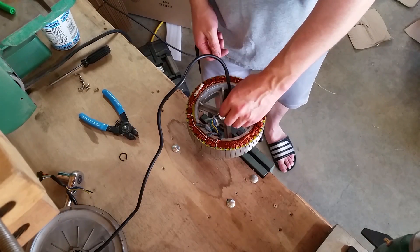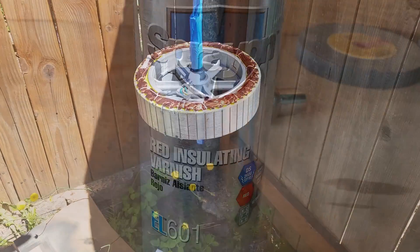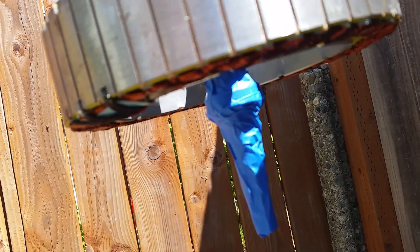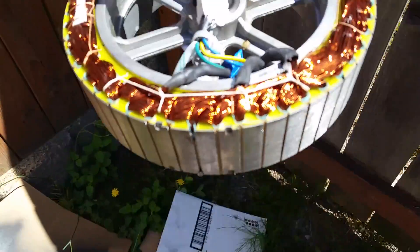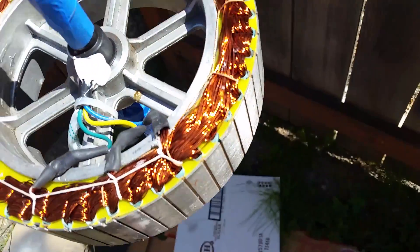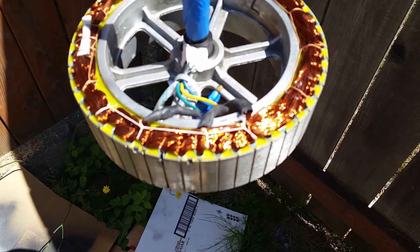So now we're going to take this out and paint it with our insulating varnish. I've taped up the axles so we don't get overspray on them, and there's a bearing still on the axle so I made sure to tape that up as well. The main thing we want to insulate is the silicone steel laminations — basically just this portion here on the stator. We don't really need to do anything with the aluminum; it's not going to corrode from water. We mainly just want to protect the steel, so we'll go ahead and get a coat on that — probably two coats. We'll also put a coat or two on the rotor and the magnets.